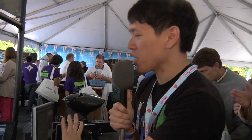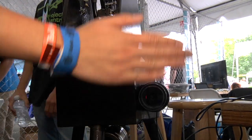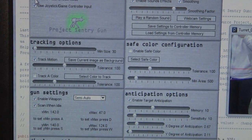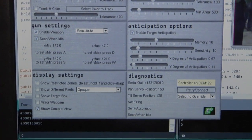Walk me through the whole system — the software and hardware. What's going on with the Arduino, webcam, and software? Basically it starts with the webcam, which takes an image of the downrange field. That image goes into the processing code, where it goes through pixel by pixel to find motion and targets, then uses several libraries to cluster the targets and figure out which is the biggest one.